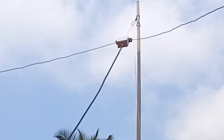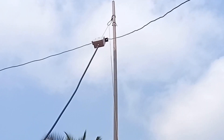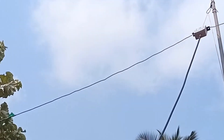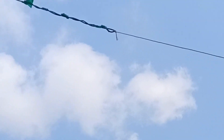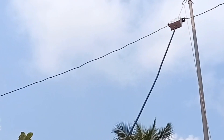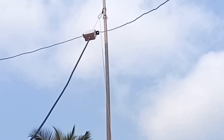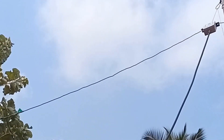As the GI mast was much more stable, I could pull up the 1:1 balun nearly to the top, leaving about 1 foot. Then I fixed the ends of the antenna elements to two other masts at about 7 feet height. In the video clip, the antenna appears to be in the sky because imaging was done from just below the mast.